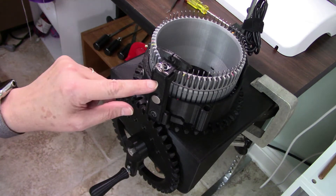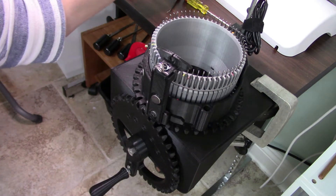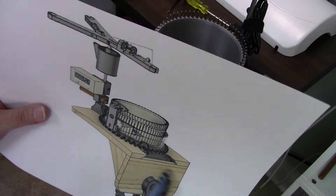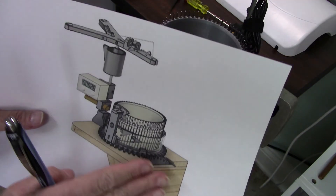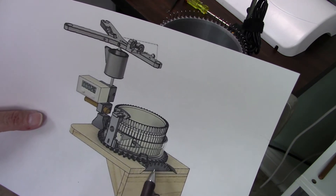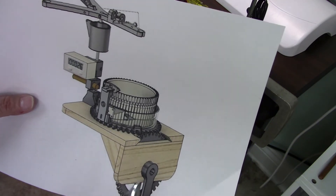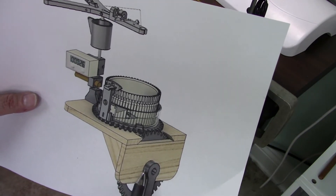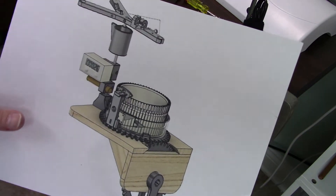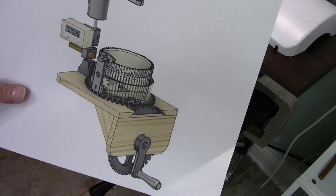Also on the frame, I changed that up there because I was changing the way the crank gear is. The original was out a little ways and had a little indentation to allow the gear to fit in there. The crank arm and the crank gear were mounted on opposite sides of the frame, with couplers that go through with a metal rod and set screws. I never could get mine tight — they kept slipping.